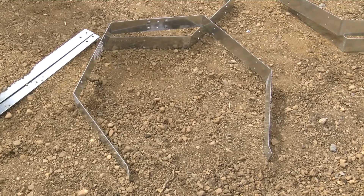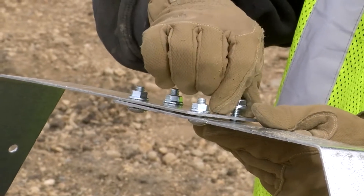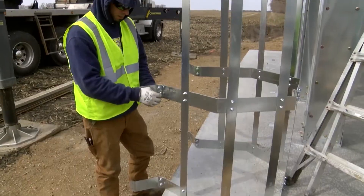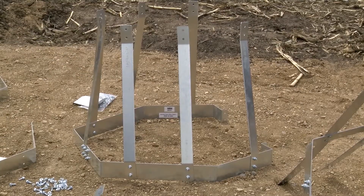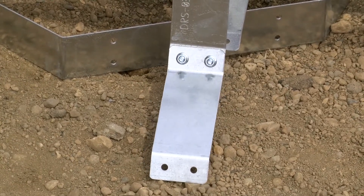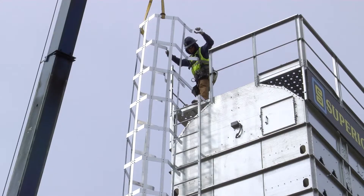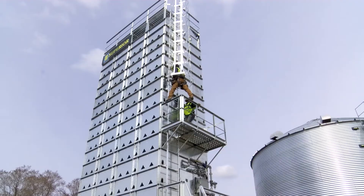The ladder cage consists of hoops and straps with the entry section having a larger hoop and entry straps with offsets. Hardware included has truss head bolts used for assembling the cage and standard bolts for mounting the cage to the ladder. Always push the truss head bolts from the inside out to prevent snag points on the inside of the cage. Begin by assembling the hoop halves together using the outside four holes and the overlap of the hoop. It is easiest to assemble the top section of cage and lift it with the crane and add to the bottom as you lift the section up. The entry cage section can be built with the offset straps attached to the entry cage. The top cage section will have four offset brackets that attach to the top catwalk while the remaining sections attach directly to the ladder. We recommend starting at the top and building it by adding to the bottom as you lift the cage up. When the cage is assembled, have a person on the top catwalk guide the cage over and attach the brackets to the catwalk. Make sure you use a harness for safety. The cage can now be attached to the ladder working your way up or down by attaching the cage to the side of the ladder.